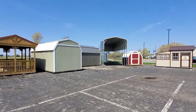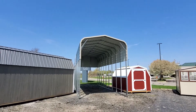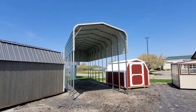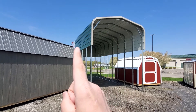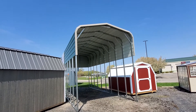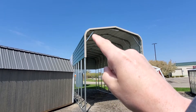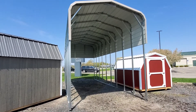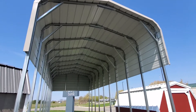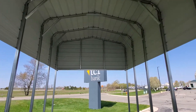There are three types of roofing you can get with the steel buildings. This is what comes standard — this is what you call a rolled rounded roof. The panels are going to run horizontally, and you're going to have that rolled rounded roof. This is somewhere in the neighborhood of a 2/12 pitch, so you gain about two feet over your sidewall height through the roof — from where your sidewall ends to the peak is about two feet taller. You cannot get this in vertical, so if you go with the standard roof, this is our most economical option. It's always going to be horizontal and always going to be rolled rounded.